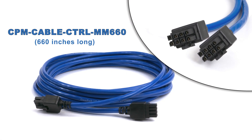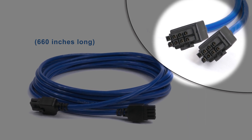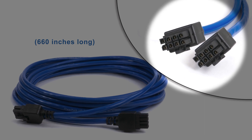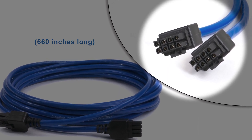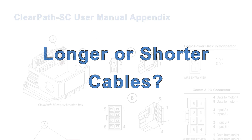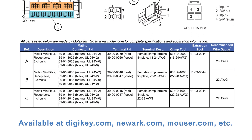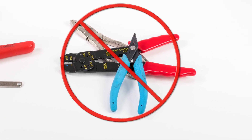The 55-foot cable has over-molded connectors on both ends. Because neither end can fit through a cable gland, you'll have to cut off and replace one connector to use this cable. This is only recommended if you have the proper tools and components to rebuild the cut end. You'll find all required connector part numbers and tool part numbers in the ClearPath user manual. Don't try to make these cables without the proper tools — you'll almost certainly end up with flaky connections and frustration.